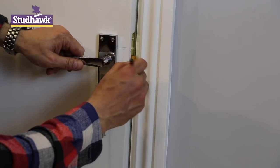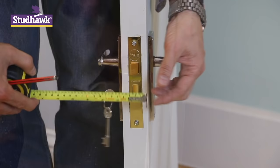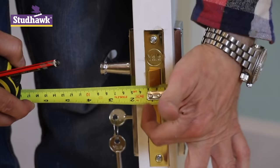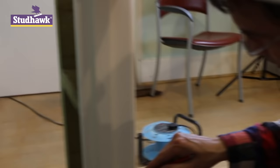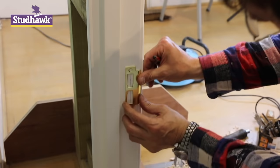Leave it open. Take the pencil, mark there — lock and latch. Hit the front. Open your door. Now we're ready to fit and strike the plate according to the two holes we've just marked, in the right position. Now I need to fit the strike plate to the front. I'm going to measure from the inside of the door to the door stop, to the edge of the latch. So I'm going to mark that there so I know where my plate goes.